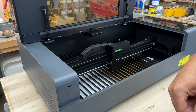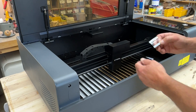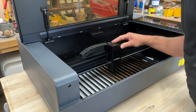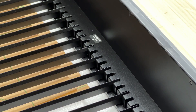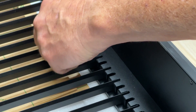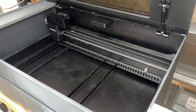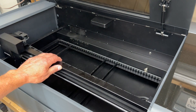To begin the setup, any of the little stickers on the machine that have a green border are removed. The first one was the lockout — that's an automatic lock that locks the cover anytime there's a job running. The next one is on the laser head itself. There's a single screw in the center of the base plate to remove it, and it contains a couple of samples of acrylic sheets and some foam padding. You also want to move the gantry to all four corners of the work area to make sure that it moves smoothly.